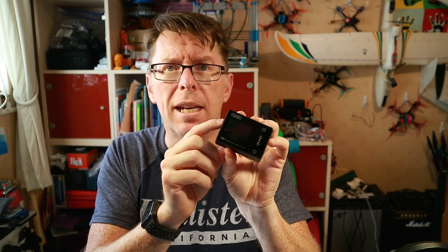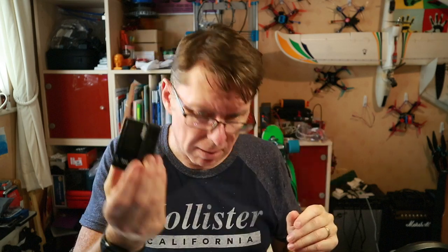So what do you get in the box? Well you get the little unit itself which is tiddly tiny. It's got input here on XT60, it's got a servo input, it's got 5 volt 2.1 amp USB output, and then it's got output there for your charger and your balance leads go in there. Instead of the little jog wheel the last one had, it's got these little sort of touch button type things. It's got little legs that come out as well, which is quite handy so it's not just flat, and that allows the fan to spin.